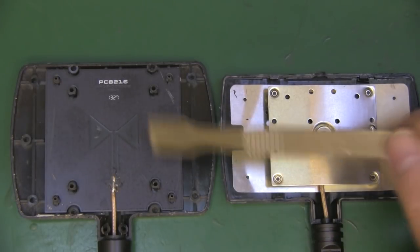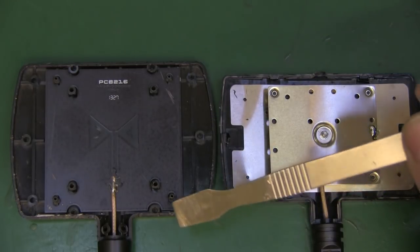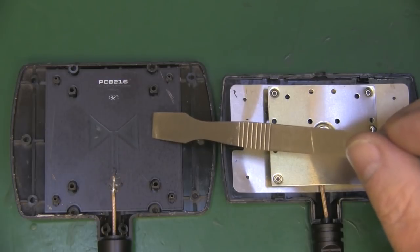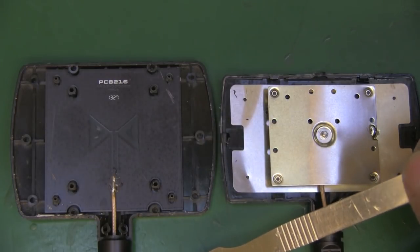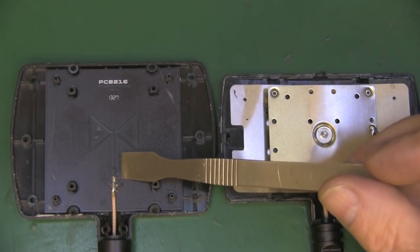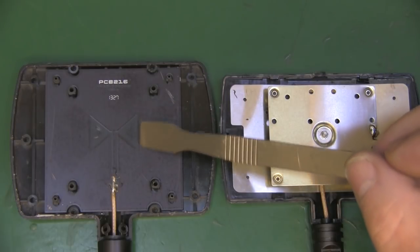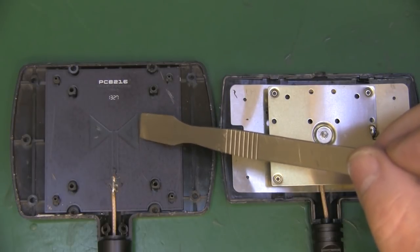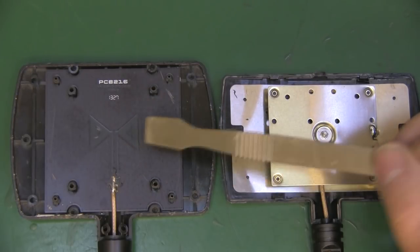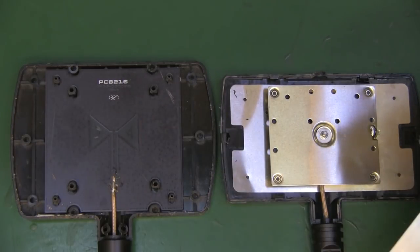It belongs in the slot antenna family tree, not the bi-quad antenna family tree. You could take this PCB and etch out a single slot and it works in exactly the same way. By going for this particular pattern, you get a little bit more gain because it's radiating on all sides — horizontal and vertical — giving more surface area and a little bit more gain. It's a very effective design and I've used it many times over the years as a yardstick. I've also desoldered it more than once to copy this pattern, etched it out, and got very good results similar to how this one performs.